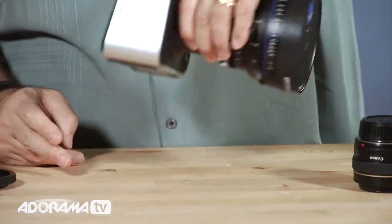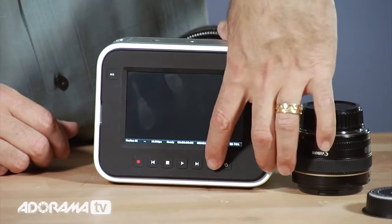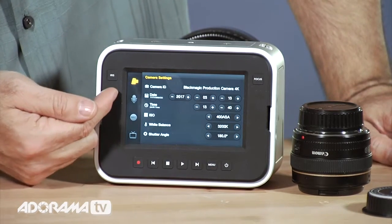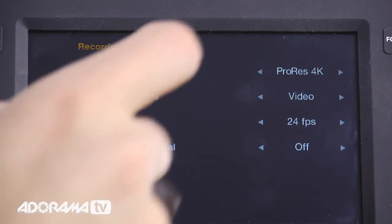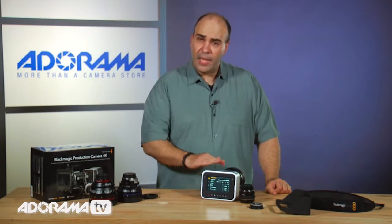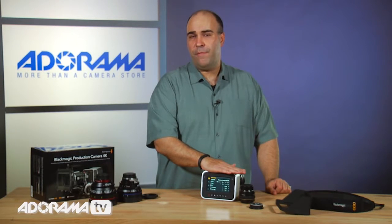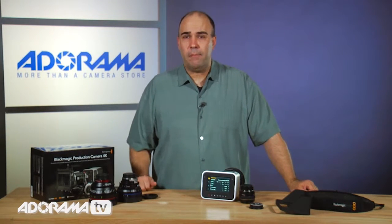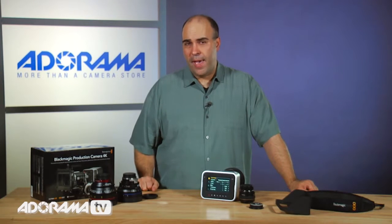How do you control this camera? Basically the viewfinder is also the menu. If I push the menu button here, all the controls come up. The controls are super easy to learn — you have a total of only four screens to choose from, and you can control all the critical things here, from the format to the audio input levels to the color space that you're monitoring in. The only thing that I see as a real shortcoming is that you can't format cards in the camera. If you need to do that, you're going to want to keep a Macintosh computer around because you need to reformat these as Mac-formatted hard drives. There are some solutions on Windows machines — utilities like MacDrive will allow you to do that on the Windows side if you need to.